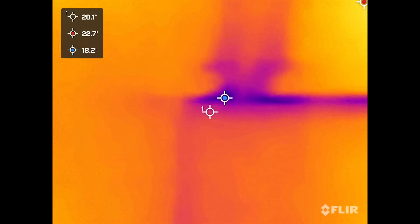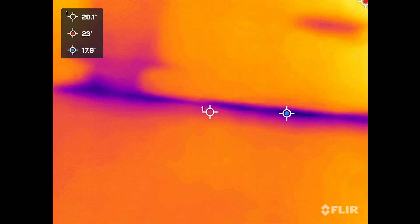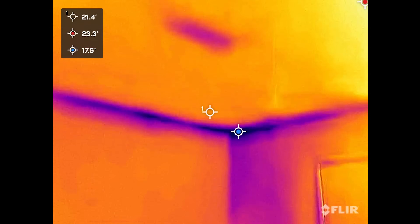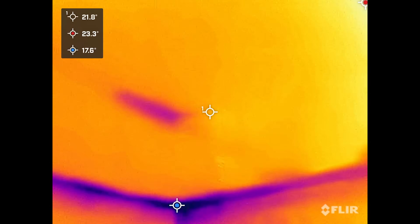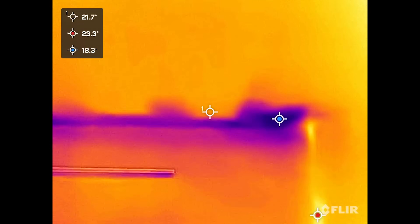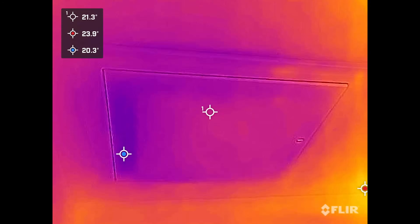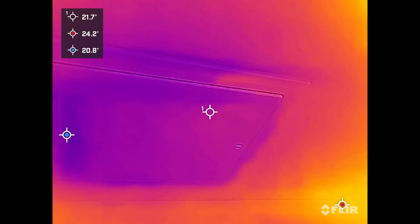If you're going upstairs, look around the corners of the room where insulation might be missing - which is what I was seeing in some of mine. Then look around the centre of the ceiling, where loft insulation might be squished, moved, or have gaps in it. This can help you identify problems with the loft insulation above. Also while you're upstairs, check the loft hatch. Loft hatches are common for leaking - not all loft hatches are insulated - so if yours isn't insulated, this should show up really quickly.